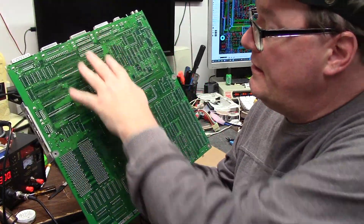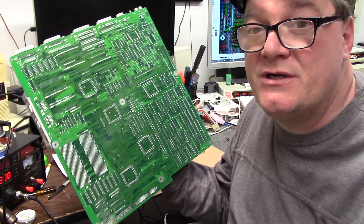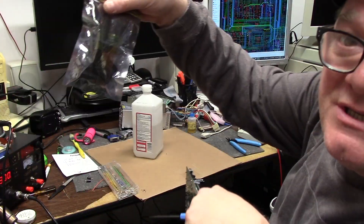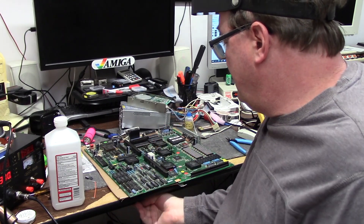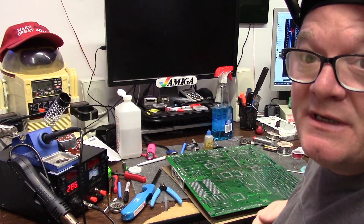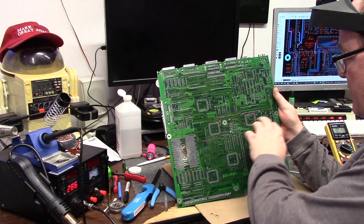I have my work cut out for me. There will be some new wires on the bottom to fix the trace mess, just to get the board functioning. Add into the fact that they put all the RAM in backwards. This capacitor next to the power rail — a) is incorrect and b) just snapped off in my hand. This one's gonna be another fun tracer. 5:14 PM — I have gone through and fixed a lot of the traces, bodge wire here and there.